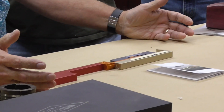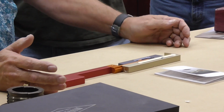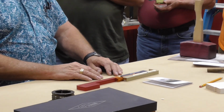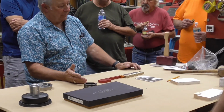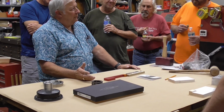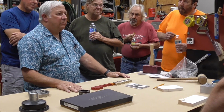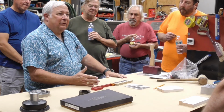And its total design is to make half laps or dados or recesses or whatever by incorporating the width of the blade, and you do it all without measuring. It's just a simple tool, if you do a lot of dados, or if you're doing plywood and you've set up a half inch dado joint, that's going to be too big. So you would have to jump down to a quarter inch blade.